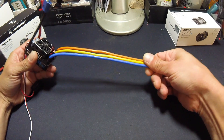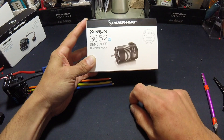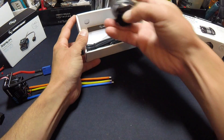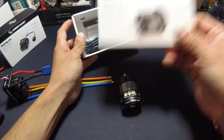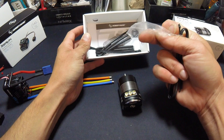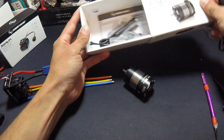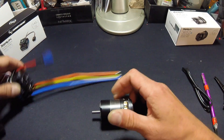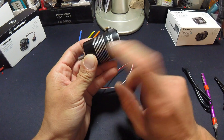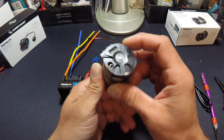We did do motor solder tab work last time but that was with the normal V10 motor. This time I have the brand new 3652 — 5100 KV. That's too fast. If you guys know me from RC, I have a saying: 'that's too fast,' and generally that makes everybody want it. So this is the too-fast edition of the motor. It comes with power wires and a 48-pitch 5-mil bore pinion gear, so for a lot of the RTR rigs — Slashes and stuff like that — it's a little short 4-pole motor that can go in and give you a good time. This is a XR8 SCT speed control, which is the big burly guy for short course, and the little tiny lightweight motor for short course as well. I'm going to try to run this in my 4x4 and see what 5100 KV being way too fast is all about.